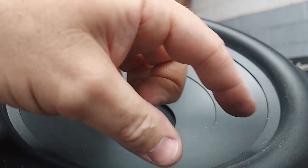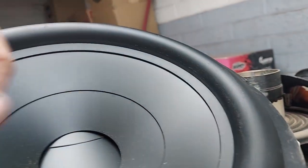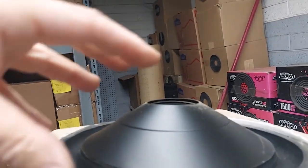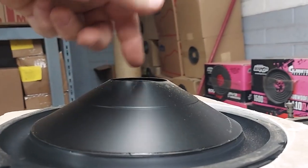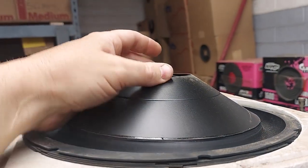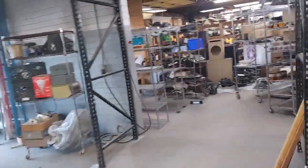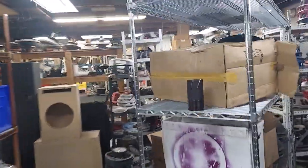I use the 200mm concave cap that sits right about here on this edge — you can adhere it there and put a decal on it, good to go. You do have to stretch out the center hole a little bit — I use a cupped wire brush that just happens to fit perfectly. You spin it fast enough that it gets a little soft and melts, then it cuts it out to whatever the JL standard is — two and three quarters. Then Jacob decided to make the new SA version 2 the same coil size as the JL coil.